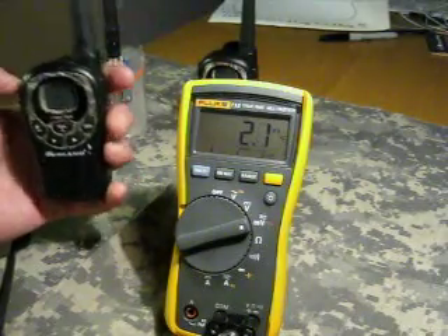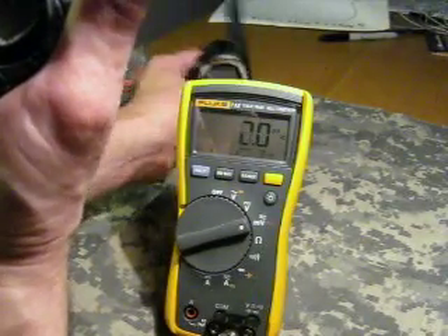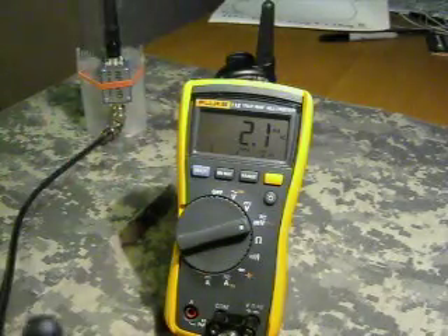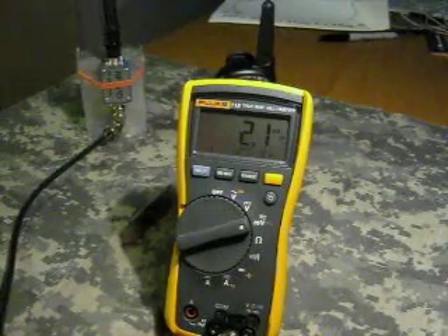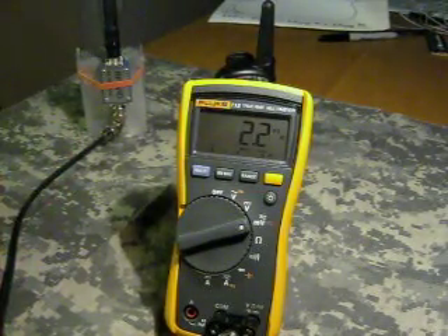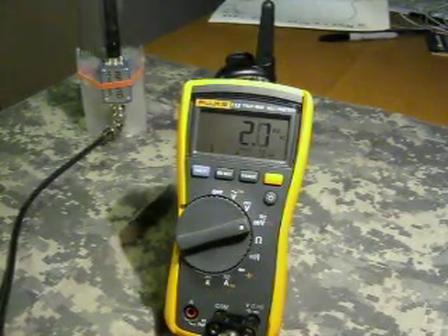It doesn't have to be perfect — a little tilt either way is fine. But you just saw what happens on this meter when somebody's holding it right-handed, and maybe your buddy's left-handed and holding it like that. You're totally cross-polarized and it's destroying your signal. That's about 20 dB of difference there, and 20 decibels for non-RF people is a decade in distance — which means 20 decibels down, you just multiplied your distance by 10.